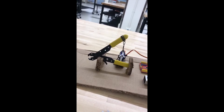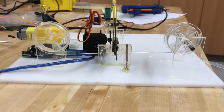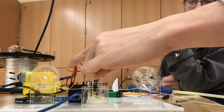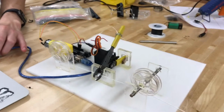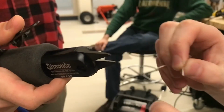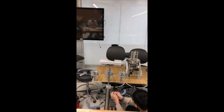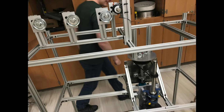We considered several design options when working on this project. It started off with crimping, but we couldn't use that because it used consumables. Next, we moved to ultrasonic welding, which is extremely expensive, so we weren't able to use it. Next, we moved into twisting the silver around the copper wire, which didn't quite have the strength necessary to be viable. So next, we moved into several different types of knots. The knots we looked at were figure 8 and square knots, but those were too complicated to make with our design. For our final step, we looked at a slip-knotted tagline with a twisted silver loop.